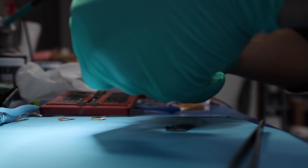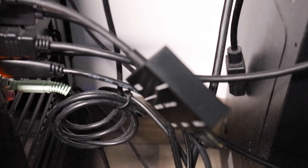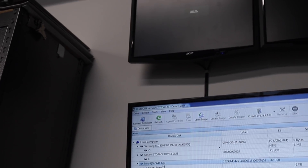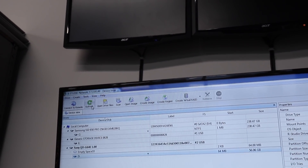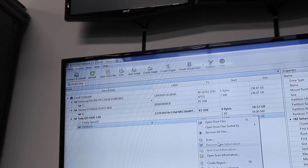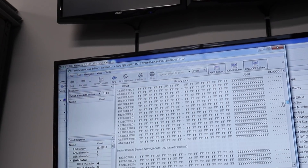I just have to cut the top off of it. Hopefully that's enough. Back here is the only computer that I have a USB-C connection on. Well, we're getting something — because now at least it's asking us to format the disk. We definitely don't want to format the disk, so we're going to say cancel. Over here is the reader for the card and it displays the volume. Now it actually shows a partition and it shows exFAT. If we go into view and edit, you can see that this is an exFAT partition, and if we scroll through it, we can actually see that there's data there.